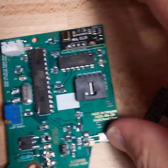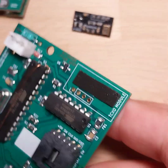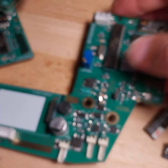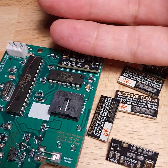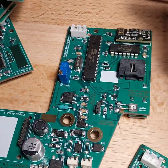I'm attaching a small piece of two-sided foam tape and then sticking the oscillator board there. It's at an angle on purpose so that it's easier to install, because there's some aluminum obstruction over the board here on the camera, so it's easier if it's at a slight angle.